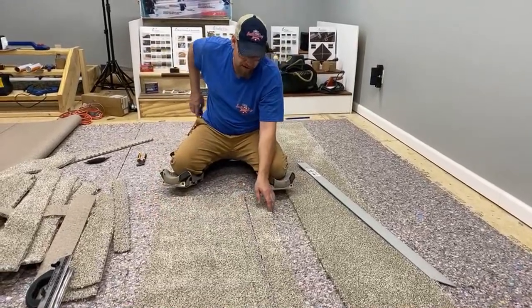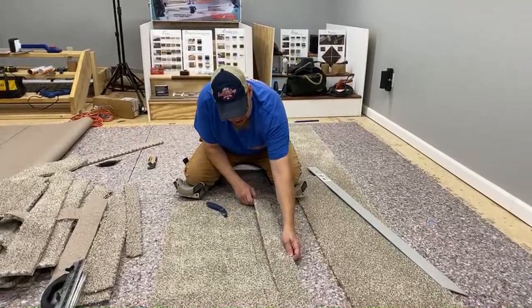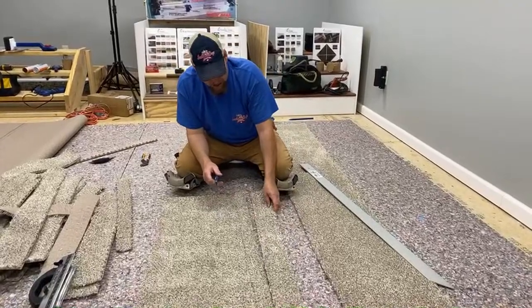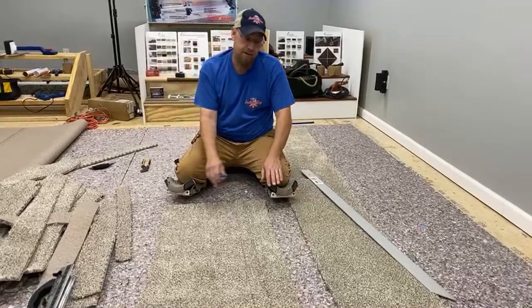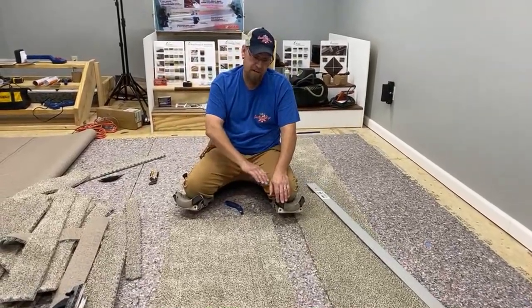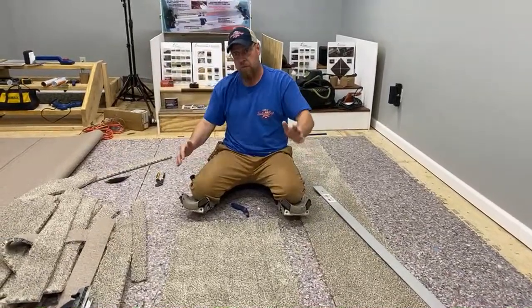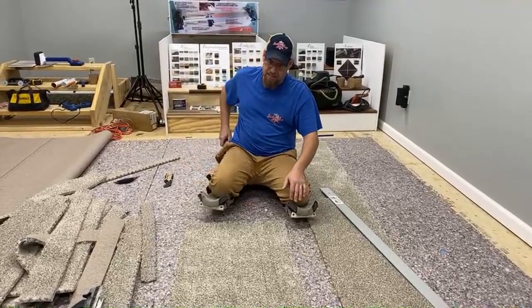The way I do that in a regular straight edge of this is I will overlap my fresh cut, mark it on the back, and then go with it. I suppose if you didn't tie anything off and your room was completely free, you might be able to guesstimate this and get somewhat close and then shift your room around to make your seam line up perfect. Would be the only way I could see to do that.